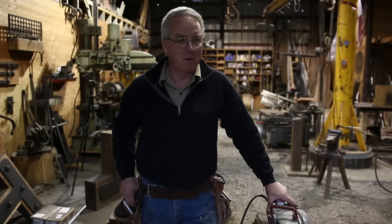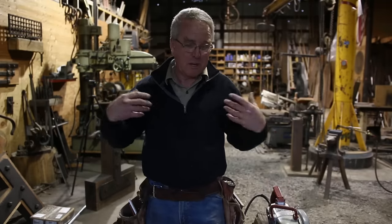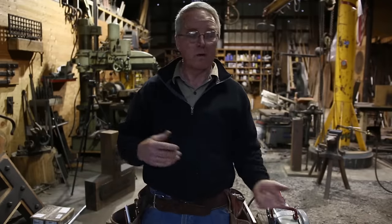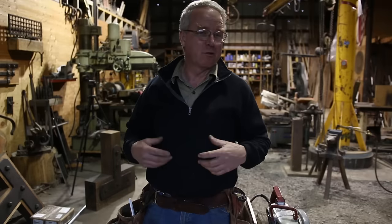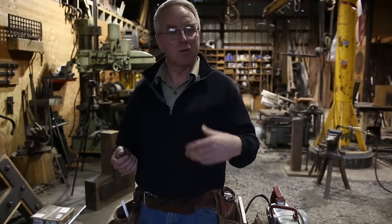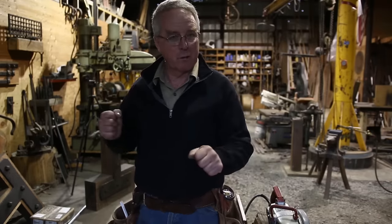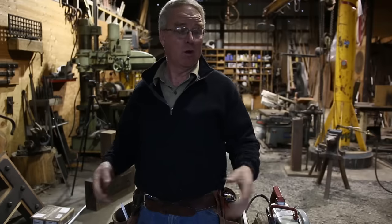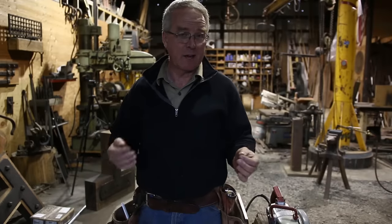That question is really only a question when you're communicating between two guys. One guy's taking the measurement, one guy's marking the board, one or the other of them is making the cut. There's sort of a standard additional call out when somebody's getting ready to cut a line where you've taken the measurement, and that is leave the line or take the line. So that indicates that additional degree of accuracy that is described by the thickness of the pencil line.